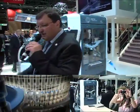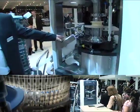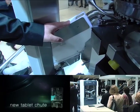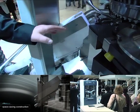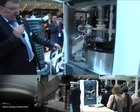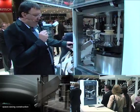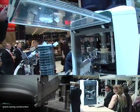After our pill was pressed, it gets back to the front again and reaches our new tablet chute. This tablet chute is dust tight, so all of the parts that touch the product are stainless steel. The sorting chutes are redirected via curves, so tablets are not damaged anymore. This also reduces or prevents jamming of the chute, so you don't have to stop the machines anymore because they are blocking the chute.